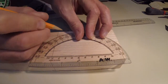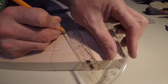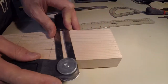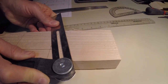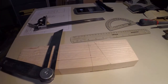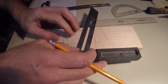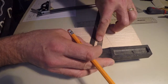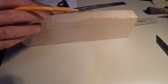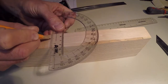We're going to use a protractor here. I've made a mark at the vertex. You line up on the vertex, make a mark at 75 degrees, and scribe that angle. Right here I'm using my bevel gauge to make that angle on the bevel gauge, and then I can transfer it over. Here's where I make a mistake — remember that mark I made at three and an eighth? Look where I put my angle right there. Three inches. That dovetail's actually too narrow. We'll go back and fix that in a little bit.